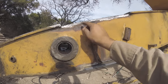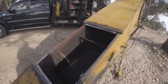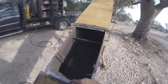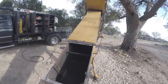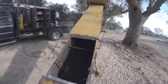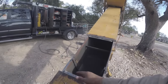Once I put that plate, I put the square underneath it, mark my line this way. Same thing here, mark my line this way. Then I'll cut this side out. And same with the other side, cut the bad part out. And so now pretty much is just put this side of the plate here, I've already got it cut out, and put a bevel in it. It should be roughly about 3/8. I think 3/8 each side or so. More or less. So it'll definitely get full penetration, except for here. Either way, I'll weld that up, and this will be done.